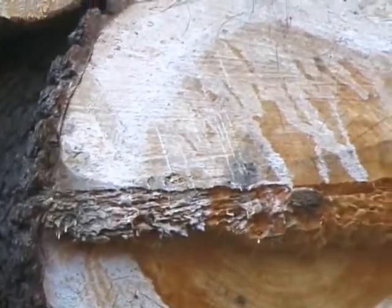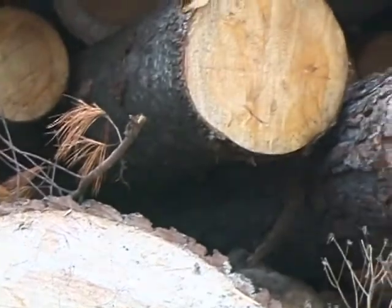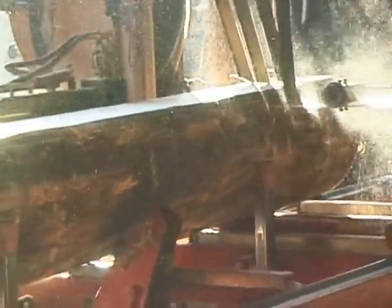When using a three quarter inch tooth spaced blade, the amount of set required is higher than with a seven eighth inch blade, because the longer tooth can carry more sawdust out of the cut. Whereas the three quarter inch tooth cannot, and requires more set in the blade to create the clearance needed to properly remove sawdust out of the cut and maintain proper air flow through the cut.